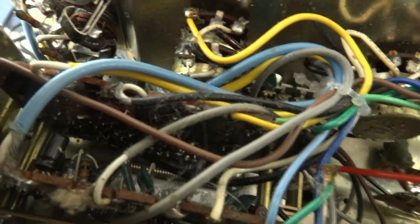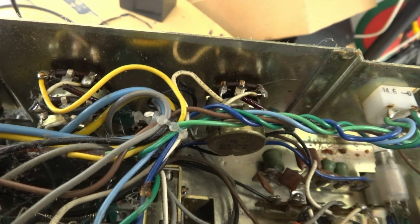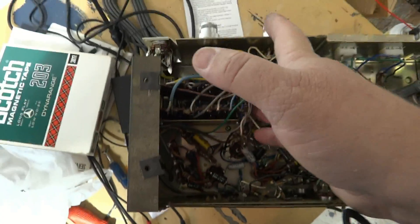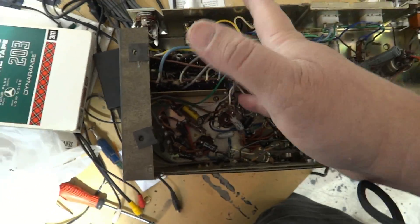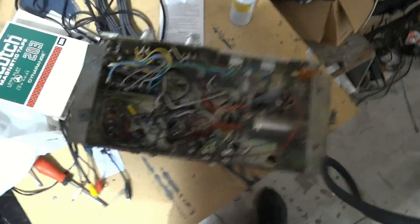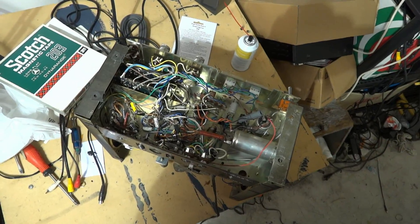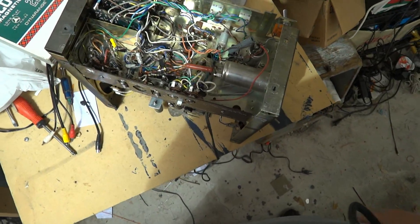I'll get the cleaner nozzle into the switch, give it a shot, give the other switch a shot, and work the record/play switches back and forth to clean the contacts that select between the record amplifiers and play amplifiers to the head. This is a two-head design, so it does use record/play switches. My other unit is a six-head design — it uses three heads for each direction: an erase head, a record head, and a play head. I don't know what's worse: having record/play switches to get dirty, or having a head selector switch for six heads — there are probably more contacts on the other one to gum up.